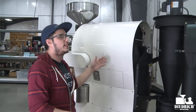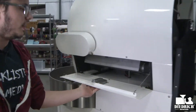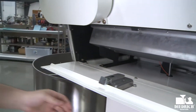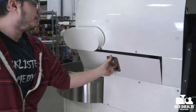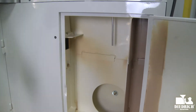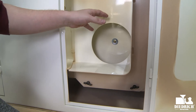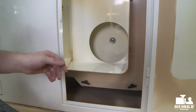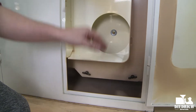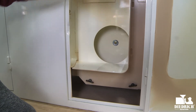Here we are on the other side of the roaster and just like on the other side we have an access door for easy cleaning under the drum and to get access to your burners. Right below here, normally your blower motor would be coming through here and then you have your flywheel — this is kind of an air housing area. If you remove these two screws you can pop out this entire bracket and get in there for deep cleaning.